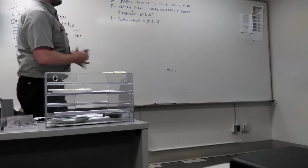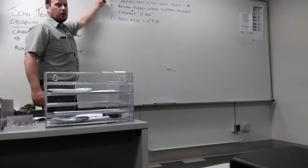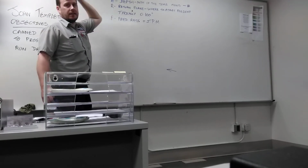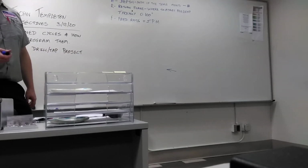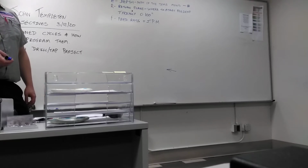So a G81, you need to put a Z, you need to put an R, and you need to put an F. X, Y is optional. You should already be in position of where you're going to drill the first hole, right? That makes sense?